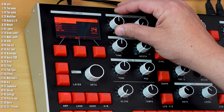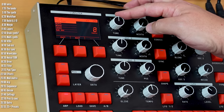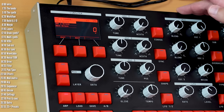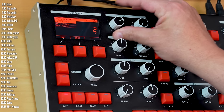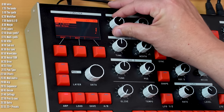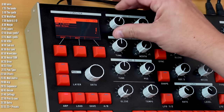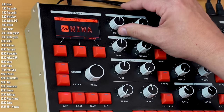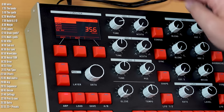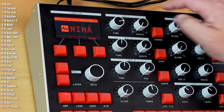Anyway, the next thing they can do, which is pretty magical, is create detents for you. So for example, tuning here is smooth as I move it up and down. But if I switch into coarse tuning mode, then hopefully you'll be able to feel this on camera. I jump between the octaves like this. So there are these detents I sort of can't push between this point, unless I really try hard. Then moving back into fine-tuning, the detents are gone. Position is saved, of course, so if this is my fine-tune, this is my coarse tune, then it will remember the position.